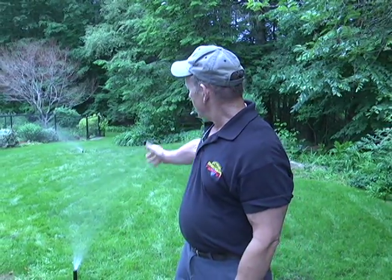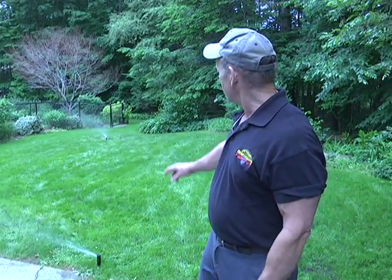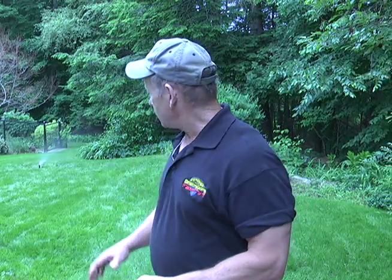As you can see behind me, we've got three heads coming up, and the middle one we just changed is working exactly as we planned. It's going around 360 degrees and covering the lawn, which was not being done before. So we accomplished that by simply changing the sprinkler head. You adjust the spray with a small screwdriver — that makes the spray fan out, and you can shorten it up or make it go out further. Play around with it; you really can't hurt it, and you'll get it to do pretty much any spot in your yard. Think it out, get the right sprinkler head, and it shouldn't be hard at all to do.